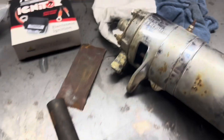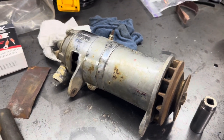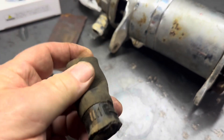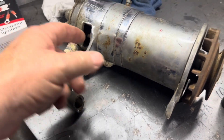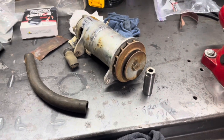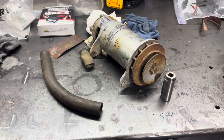I've also had a hose that came up over the top or around and made a big — like a question mark — and that was supposedly to prevent cavitation. One problem with this hose is it's so thin and it was too long, so it kinks — either here as it goes underneath the engine or down at the water outlet. The rest of the video should show how to modify that water outlet too. If you do those things, you've got a chance to keep the bullnose from overheating occasionally.